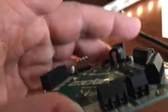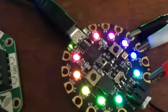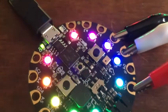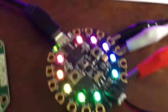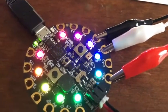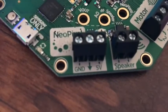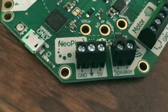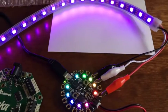This Circuit Playground uses alligator clips already wired in. I plugged into voltage out, pin A1 as the data pin, and ground. Make sure you get the colors right: red is power, black is ground. A NeoPixel needs three pins — power, ground, and data. That's my little toy — just playing with it, with lots of things still to do.